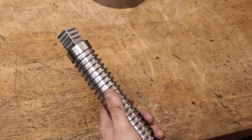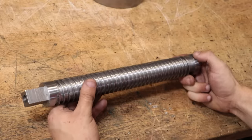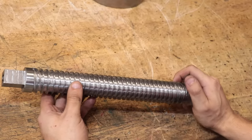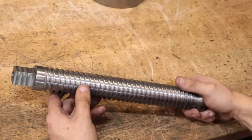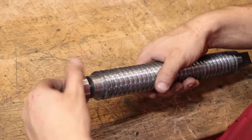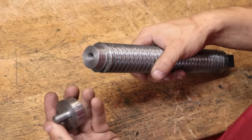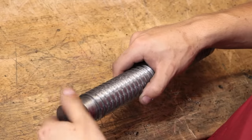And that is the lead screw done. On the whole it's okay but I probably would have wanted it to be just a little bit better. Surface finish on the final pass was a little bit rough — I think the cutter was just a little bit blunt. The part also did slip in the chuck ever so slightly but I managed to catch that before it did too much damage. I also had to make the end sort of screw on, which unfortunately makes the split ring a little bit unnecessary. A normal retaining ring would have worked, but since I didn't know that when I made it I'm just going to leave it as is for the moment.